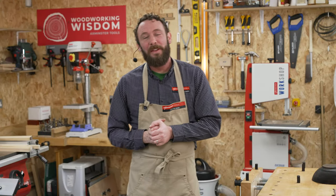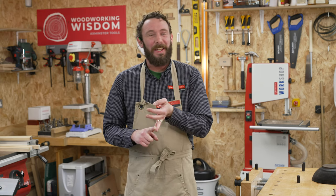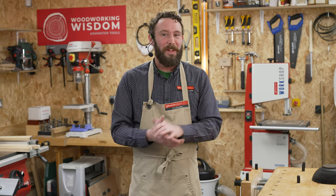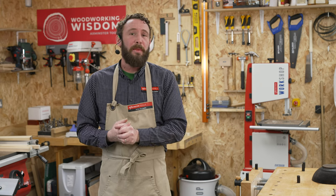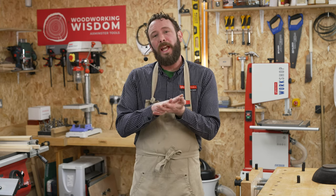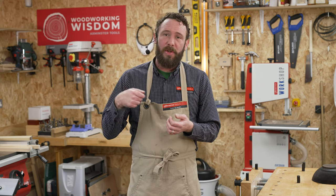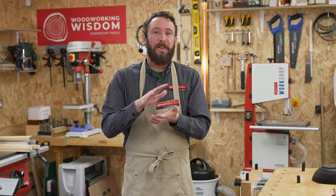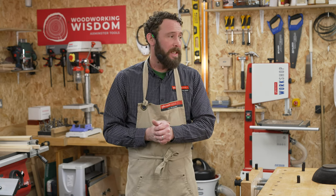So we've been outside, we've done our scorching. We've scorched a bowl and a little musical toad thing, and also we've used the black ebonising lacquer to spray just a flat panel. These are going to be great ways to show you what I've got in mind. You don't have to use a spray can, an airbrush will do the same thing. We're not looking at stains, because the stain's going to penetrate into the wood. So if you were to colour something with a stain, as you carve down through, you're not going to get the same sort of definition. So this is a surface layer of either carbon in the burnt one, and that spray, the ebonising lacquer, on our flat panel.